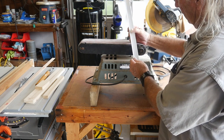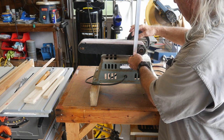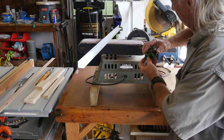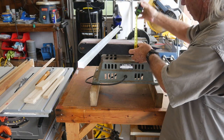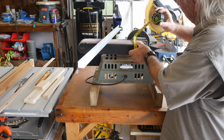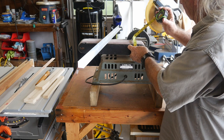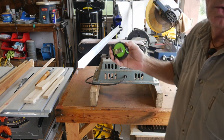For strength I'd like to go across this with the 90 and have some support where the bend is. I'm going to bend the tape measure a little bit over it and get a rough estimate on what we need. Looks like from the bottom, come up, do the 90 at about two and a half inches, then go across to seven — so seven inches of material total should give me what I need. We'll cut this at seven and go from there.